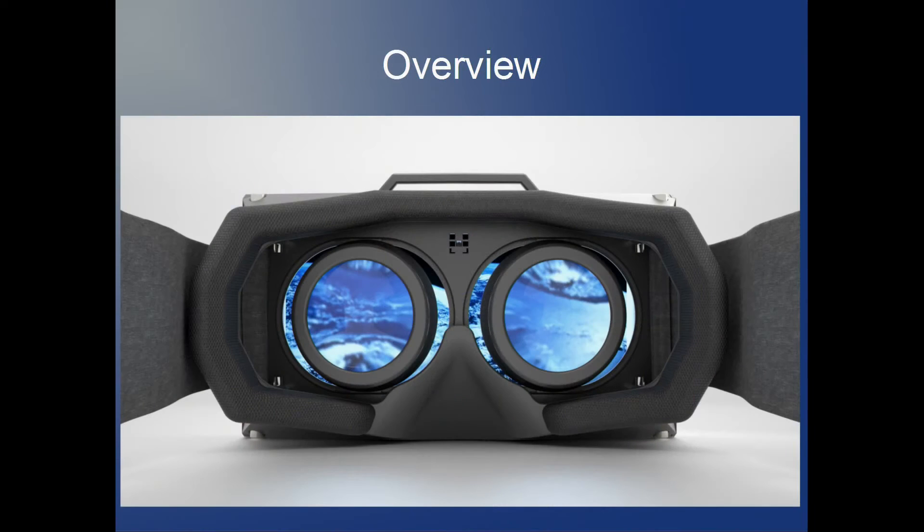I got really inspired by the Oculus Rift, which I got to test out last summer at a buddy's house. It simply used an LCD screen and two optics which allowed the user to look at the screen, and more importantly allowed the screen to be zoomed in very close to the user's eyes — about three inches away. Normally you can't focus on objects closer than about four inches, but the Oculus Rift solved this using lenses. My project aims to do the same thing, letting you look at your smartphone from about two and a half to three inches away using aspherical lenses, within an enclosure similar to what you're seeing here.